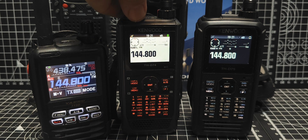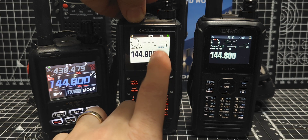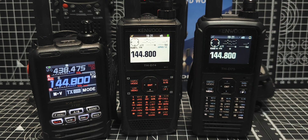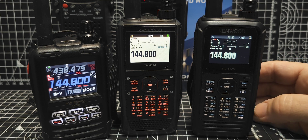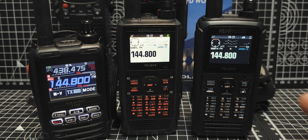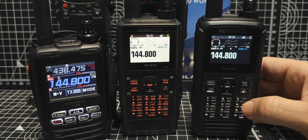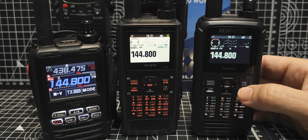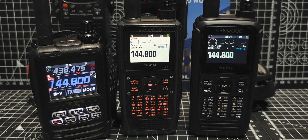To turn APRS on now, we go F then 5. That's on. The 12 means 1,200 baud rate. F5 once says APRS, F5 twice says KISS, which is TNC. So we'll go F again, then number 5. Now we're going to tell it how we want to transmit.